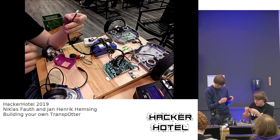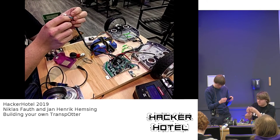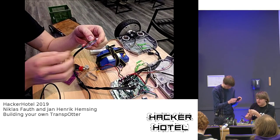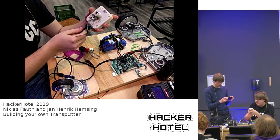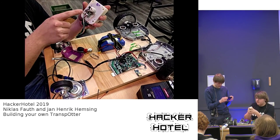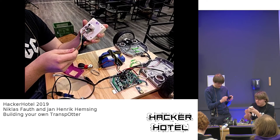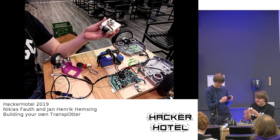And the way this works is you got black, that is ground. You have red, this is 3.3 volts. And you have two additional wires, and those are the analog inputs for the main board. And as Jan Henrik told you earlier, the game track uses potentiometers as a voltage divider. So if you apply 3.3 volts, you get a voltage of 0 to 3.3 volts out of it, depending on the length and the angle